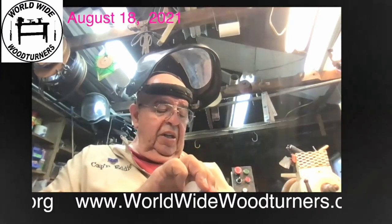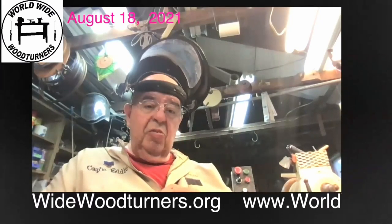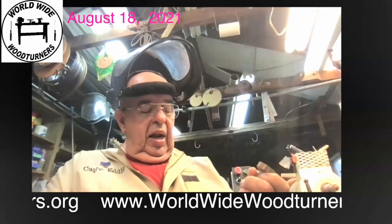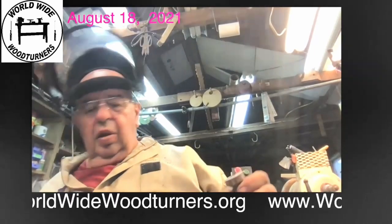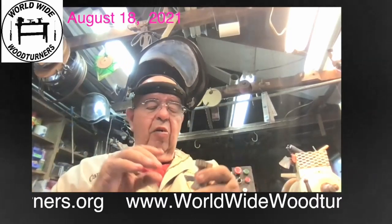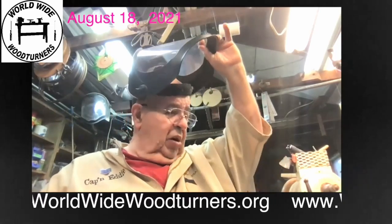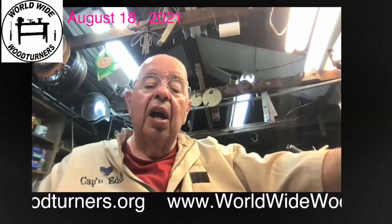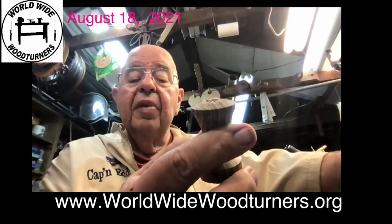I'm going to drizzle a little bit of CA down here and let it set for a little while, which means you and I will not be doing this together. And then I put it back on my mandrel. A little line of CA, not the medium thick, but a little line of CA will help you recreate those threads again and get them back on. But all in all, it was a quick project. We always talk about how fast these things can go. That is what I have left. I should have finished it up, but I couldn't get there.